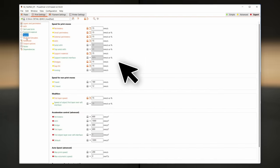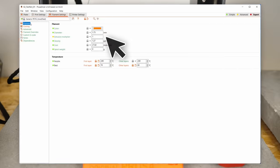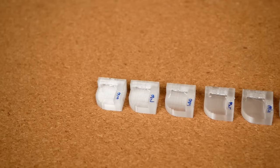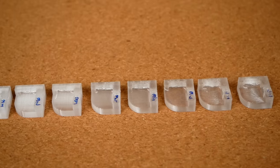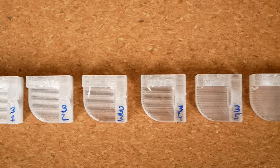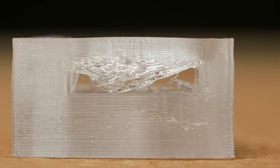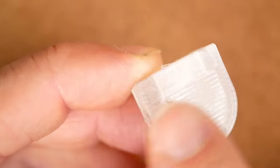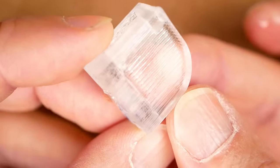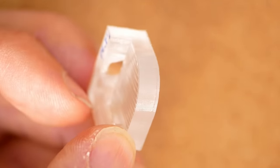I also limited speeds to only 15mm/s and turned cooling off. The first and probably most important parameter I played around with was the extrusion multiplier, which I varied between 91% and 105%. The parts got clearer the higher I set the extrusion multiplier, and I already got really great looking parts at a bit above 100% flow where the material was able to flow into all remaining cracks and voids. The parts didn't get less clear at higher extrusion amounts, but you'll get slightly larger parts due to overextrusion and really rough top surfaces. Off the bed the parts might not look as nice as in pictures — I used glue stick on my bed which leaves a matte bottom layer — but if you polish them up or add a drop of water or oil, you can see how clear the inside of the part really is. The side walls due to their roughness are still not perfectly transparent, but even lower layer heights might help in this regard.